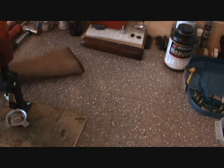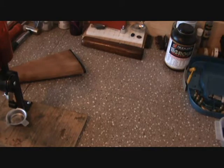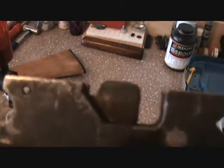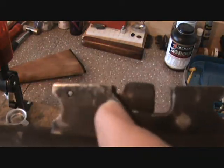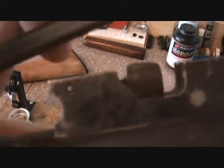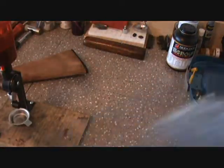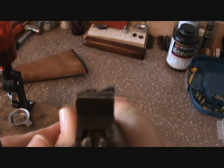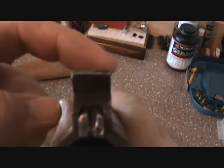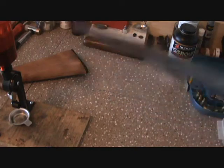The problem is right here — when you lock this in, when the ejector is locked into place, you get this little hook. The hook's in here and I've already reshaped it a little bit, but if you look, this thing is actually sitting up higher. That's why it's keeping it from locking. It's actually bottoming out in the receiver, so we need to straighten that out or replace it.